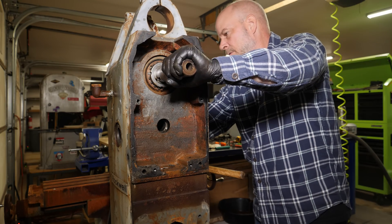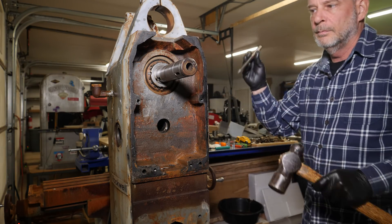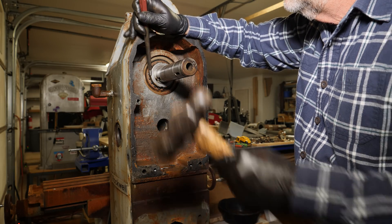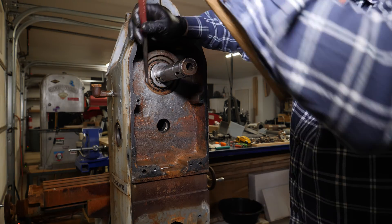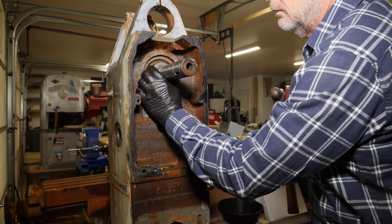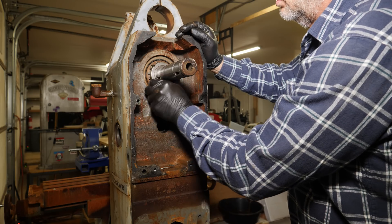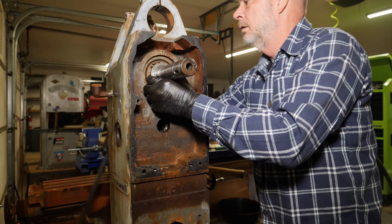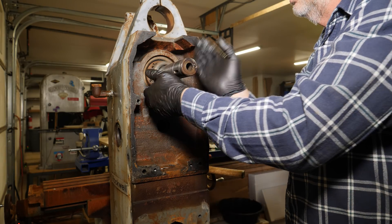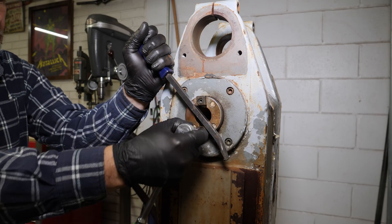Here's the bearing retainer for the spindle and I'm just locking a pry bar in the front so that I can get the retainer off, and under that is the bearing adjuster. The spindle is NMTB 30, and if any of you have any information about the arbors that are used or the overarm support — all of which I don't have and there's not very much information about — I'll probably wind up having to make it, but if you know anything, let me know.